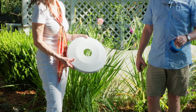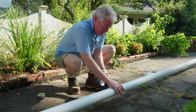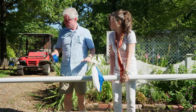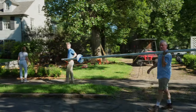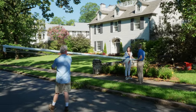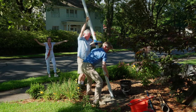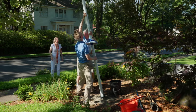For this install, we opted to use a flash collar to cover the bottom of our pole. Before moving the pole to the hole, we taped our flash collar up a few feet from the bottom to keep it out of the way until we needed it later. With all of the hardware in place, carefully walk the pole over to the hole. Have one person hold the bottom of the pole and guide it into the hole while the other person walks it into place. Once the pole is in the hole, try to get it as close to the middle as you can.